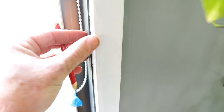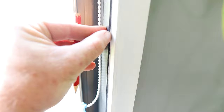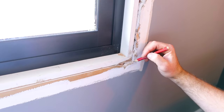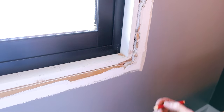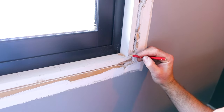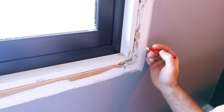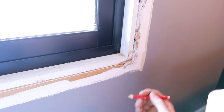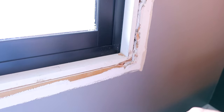This is an existing window with an old architrave and what I want to show you is the quirk. Quirk is that little lip between the architrave and the window — it's a very small gap. Three mil is pretty much what you're aiming for. It can go bigger or smaller as long as it's consistent all the way around. With our new window we want to mark that on the window and then transfer those marks onto our architraves — that is going to be the mark we cut to. You can use a packer or a tape measure. I just eyeball it, and as long as it looks good that's all that really matters.